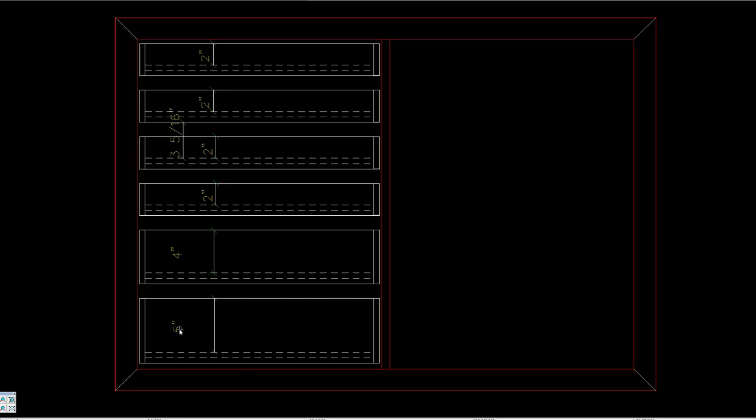So we have a drawer at the bottom. I have a 5 inch interior height plus the distance between this drawer and the other drawer. So you'll be able to put items in here that are, say, 6 1/4 inches tall. Then we got our 4 inch height plus the extra space, and then our 2 inch heights plus the extra space, until you get to the top drawer where you just have 2 inches. If it protrudes out from the top of the top drawer, it's going to hit the face frame. So that's what we have now with our 6 drawer layout. I have flexibility in the height, as you can imagine, so just let me know if this works out well for you. And that's what I have for your drawers.